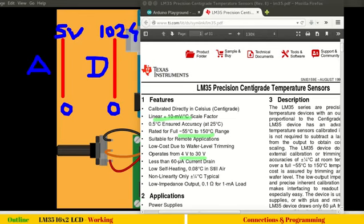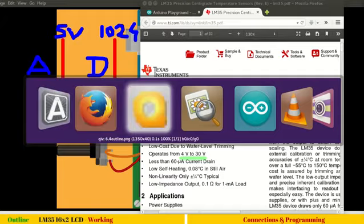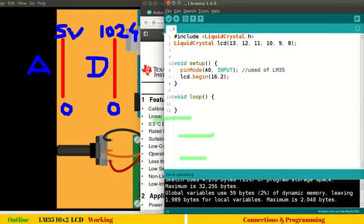Anyway, we will not get into the complete datasheet. All we need to know is to read the number of samples received from LM35, convert it into voltage, and hence get the output in temperature, degree centigrade. If you are interested in the datasheet, which you should be, because it's a very good practice to go through a datasheet before assembling any hardware, you may visit ti.com/lit/ds/symlink/lm35.pdf, or you simply search in your search engine and you will probably get the LM35 datasheet in the first result. So let's move further and come to this Arduino IDE.